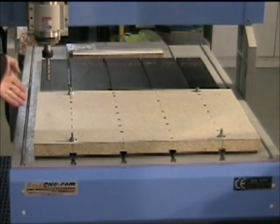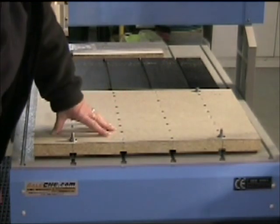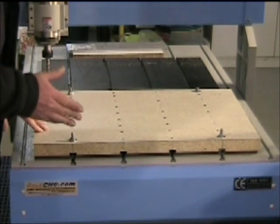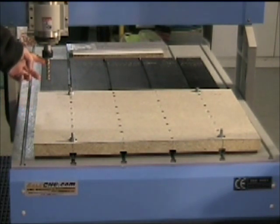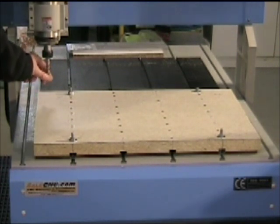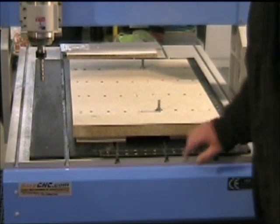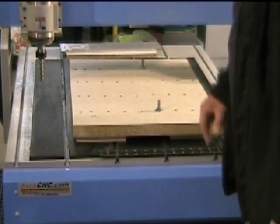What I need to do now is square the three faces up — I'll probably do the back face as well. It's important to get these faces nice and square, and square to the machine edge here. That gives me a good reference point to place material in here to be machined. I've got a 12mm, 100mm-long, three-fluted end mill which is normally used for aluminium — perfect to do this. It's roughly squared up to the front edge of the machine, and the tool will run around it and square all that up nicely.